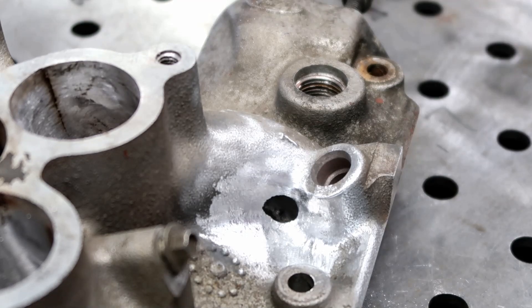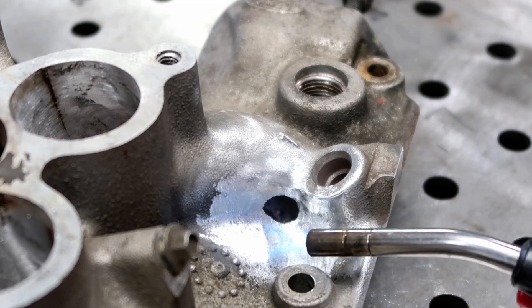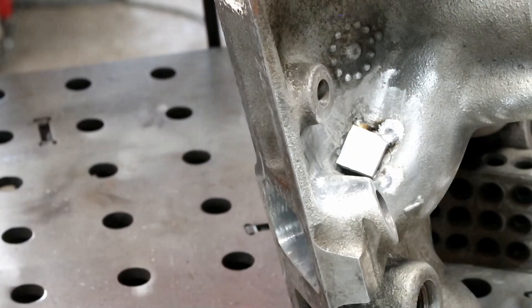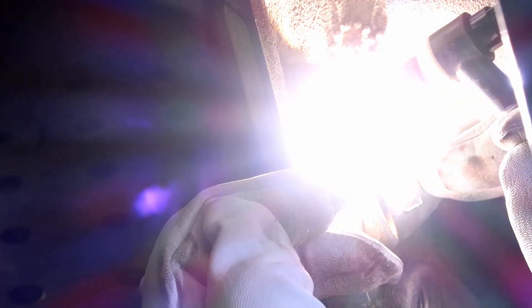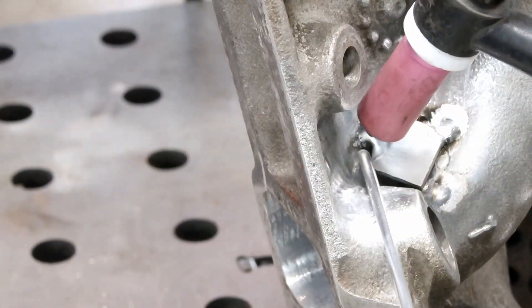Next we're going to bring out the torch and apply some higher concentrated heat around the problem area. The intention is to bring out any impurities resting just below the surface and give us an even better chance at cleaning the area up. In this case I have a chunk of raw aluminum tacked to the top of the hole because I couldn't fit a copper backer on the back side. Strike your arc and ease part way into the pedal. Hold your torch stationary for three to five seconds until the contaminants have burned off the surface. Once the contaminants have burned away, start moving forward and feed as much rod as you can into the weld. Since the customer was going to continue porting on the inside of the intake plenum, I made multiple passes to fill that valley up so they had plenty of meat to grind back out for their port job.